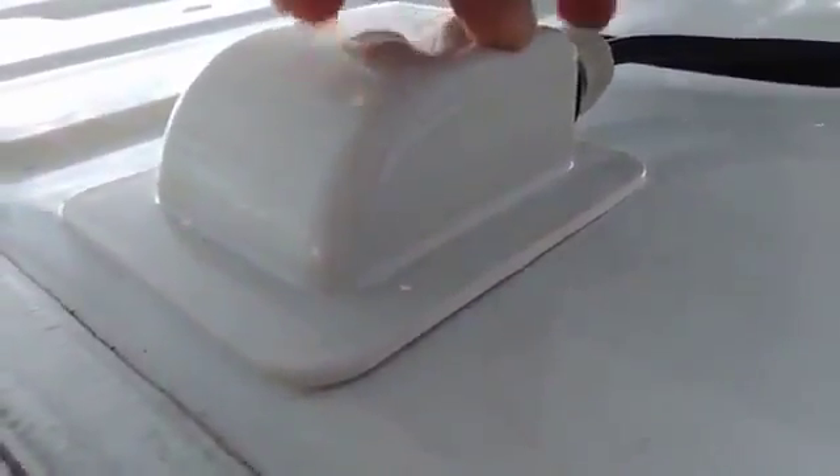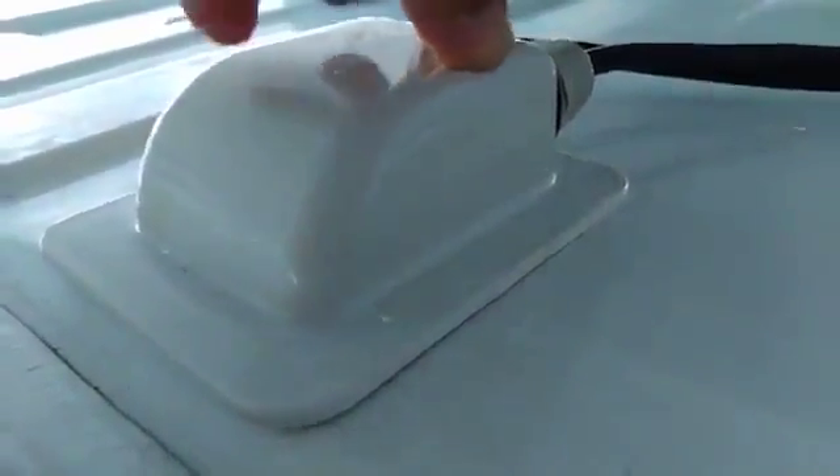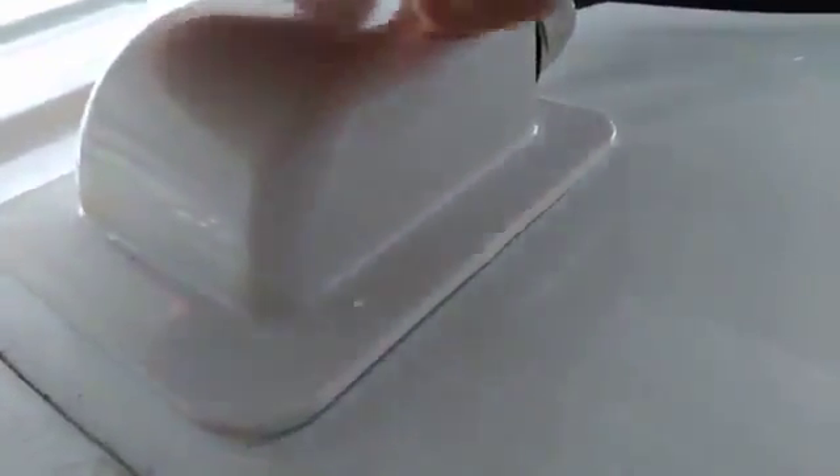I separated the cables here so I don't have to deal with two cables twisted together — it would have been a terrible tangle if they were twisted as one. So I separated them so each cable is independent coming in. When you tighten this down, it actually closes the gasket. There's a gasket here, so no water should enter it.